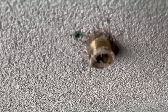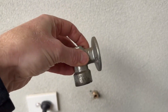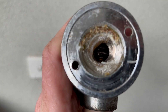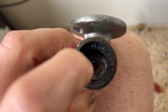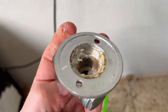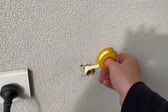Alright, we're just left with a brass thread coming out of the wall. I'm going to put a cap on there to do another gas test. You can actually see the bayonet we've taken off — the gas goes through there and you can see that spring at the back. When you plug in a hose, you can see it lifts up on that spring. Inside it's obviously just not seating properly, or the rubber washer has perished — either way, gas was escaping out of there.